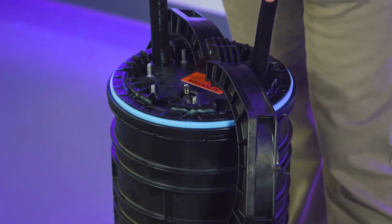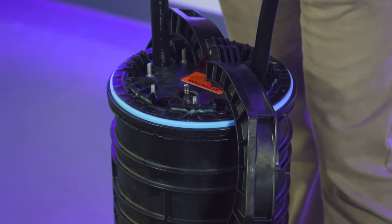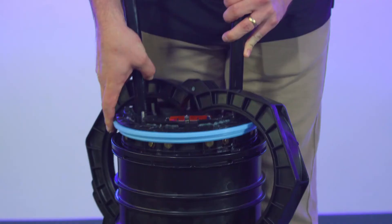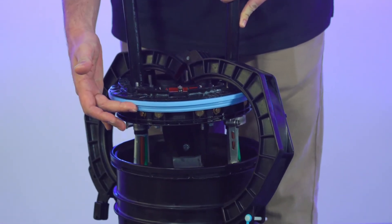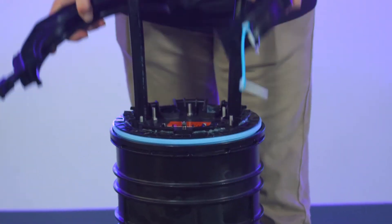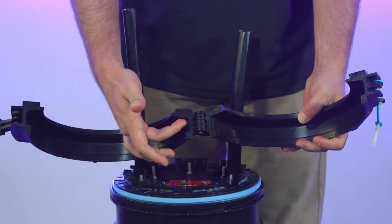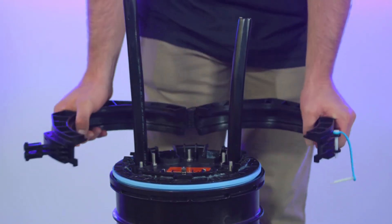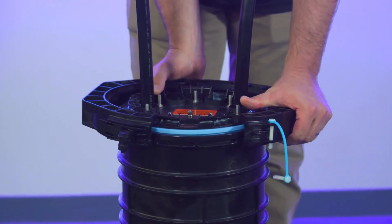The second way of installing the nine-and-a-half inch dome collar is with the dome closure oriented vertically. Once you've finished all of your splices, make sure that the gasket is installed properly with silicone lubricant — it'll help everything seat into place properly. Then make sure that the channel on the inside of the collar where the hinge is is the first part that goes on.